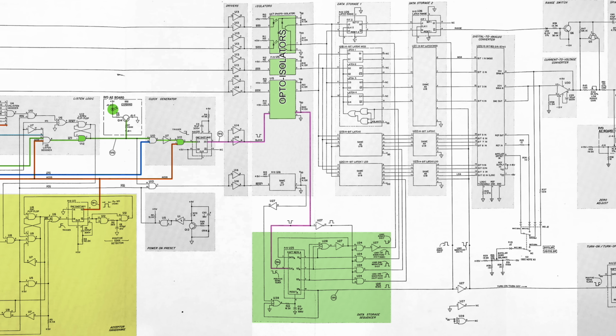Oh yeah. The next time my 3-year-old nephew manages to count up to 4, I'll bestow him with the title of Data Storage Sequencer. This prodigious circuit is implemented with a shift register that shifts a single bit around, so its 4 outputs turn on in sequence, one at a time. They'll each enable a latch chip where our data byte will get memorized. The first data byte gets latched into a simple flip-flop, which only cares about bits 0 and 1.